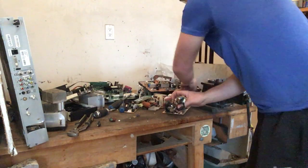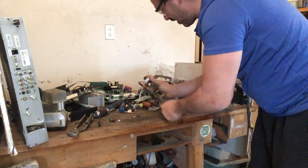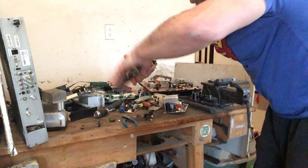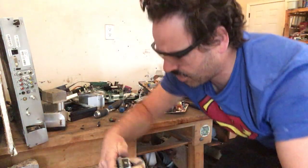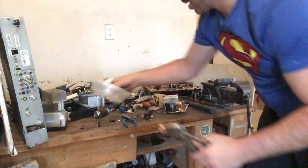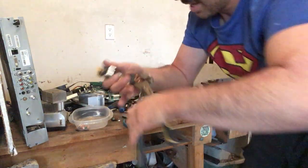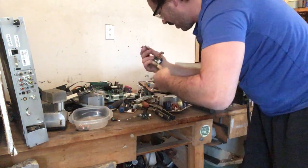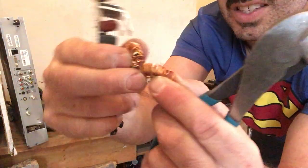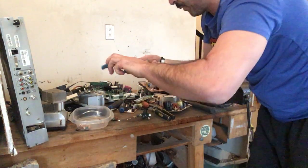Because I am not saving this circuit board, I can just go ahead and cut through it. The circuit board is going to be bent or broken, and scrap yards will still take all of it. I'm just going to quickly pull out these donuts — very easy. I'm definitely making sure I'm wearing safety glasses. Because there's a little bit of glue on them, I just want to twist them. There is a little copper donut underneath that I do have to break off, so I cannot get clean number two copper for this because there is still a metallic or magnetic donut in there. But still some beautiful number two copper.